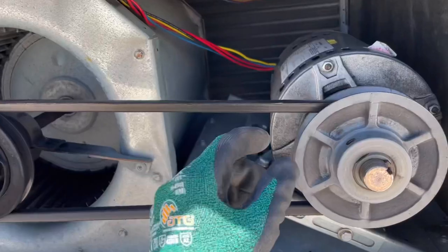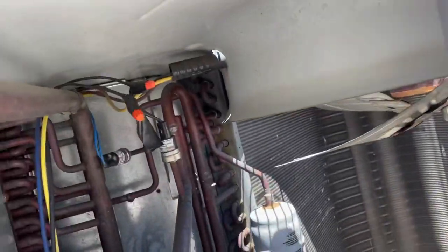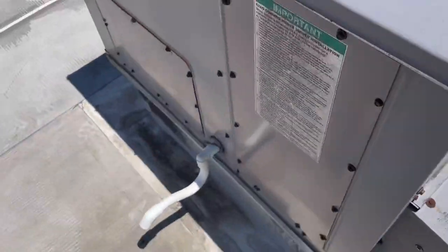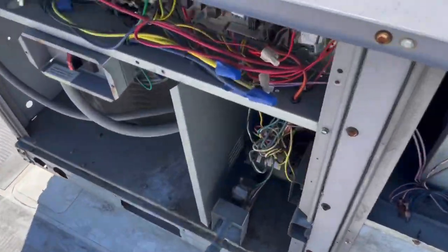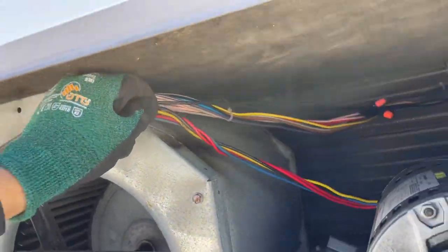That's what caused it. Just coincidentally there was a power outage recently — vibration, lack of maintenance. With your maintenance, it's a big thing. Check set screws, check your belts, check tightening and tensioning, make sure there's no cracks. Check your air filters — just the basic stuff. I could put a little bit of tape around there, which I will, because I do not want callbacks. We're looking pretty good other than that wire. Let me go ahead and do that, reset this breaker, and fire this bad boy up.